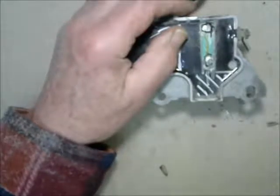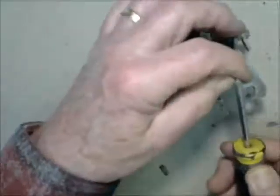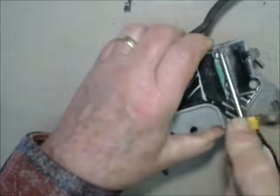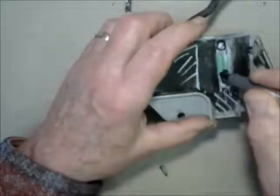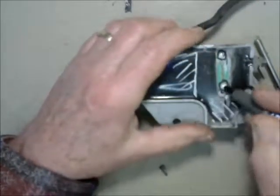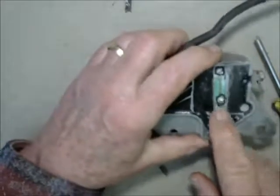I took an old screwdriver and fashioned a chisel-like tip on it — I think that might be a better tool to clean off some of this epoxy. This is one end of the capacitor that goes off to the rest of the circuit; this end down here looks pretty easy and clear to work with. The capacitor is connected to ground, so what I want to do is disconnect the capacitor from the rest of the circuit so I can make a measurement on it.